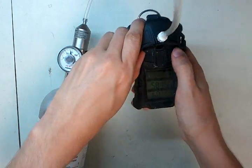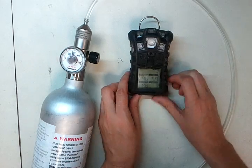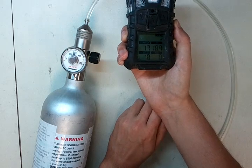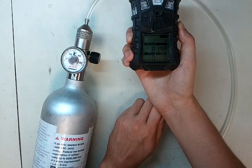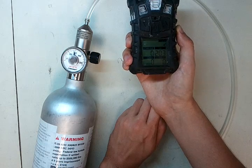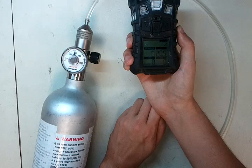Take off the regulator and put that to the side. Now you'll start to see the values coming back down. You'll see a check mark in the upper right — that means it was successfully calibrated today. The numbers will start going down towards 0. We've got 0 on all sensors except O2, which will slowly go up.